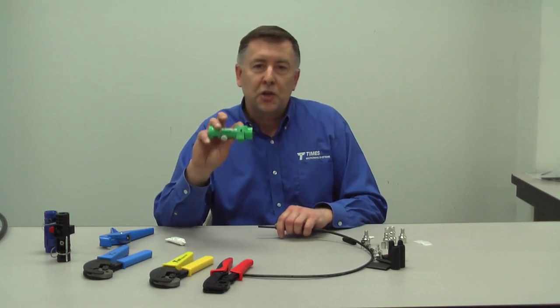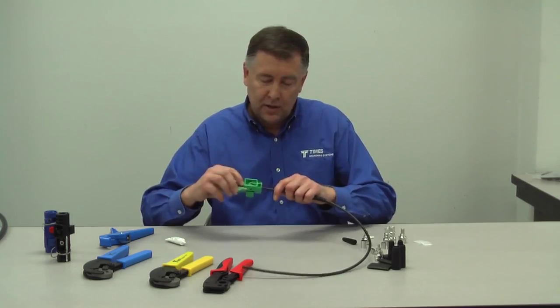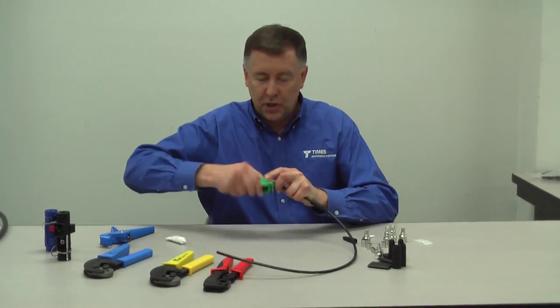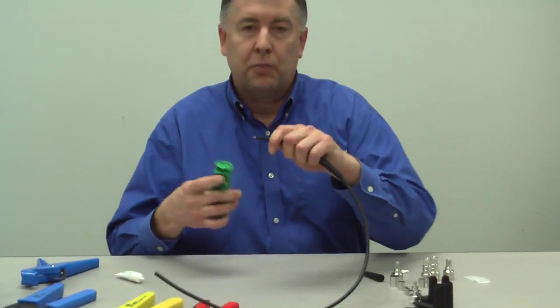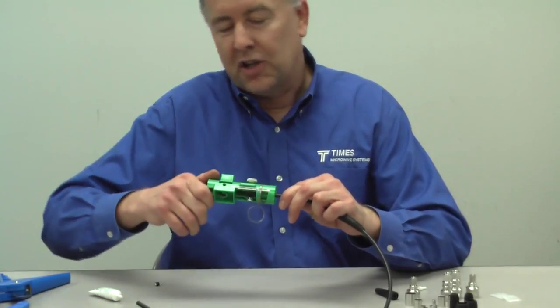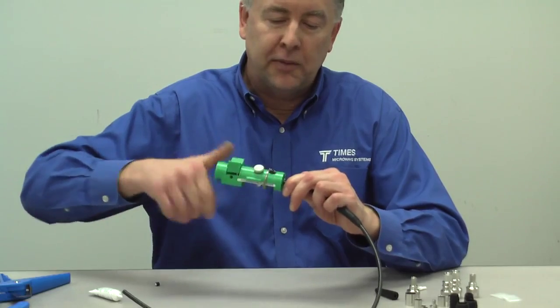You take your CST 240 tool, take side one, make sure it's cleaned out, place it over the cable, start to spin and push down on that thumb switch. Once you've made one or two revolutions, keep it depressed, pull it off, expose the center connector, flip it around to side two, make sure side two is set for straight, and you just spin that until it spins freely,